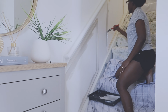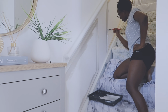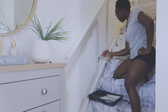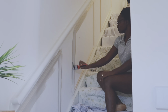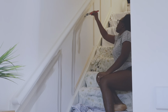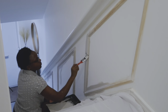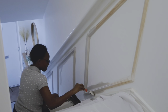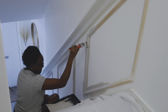Okay, so I'm just using it to paint the panels, the side that I've paneled, painting all the paneled side first before I start painting the whole wall. In that way, by the time I come down and I'm painting the whole wall itself, those ones will be drying up. And when I was doing this project, I opened my main door down outside. You can see the other side. When I finish, I opened the door down to let the paint dry. That's how I managed to dry the paint off quickly to continue most of my work.